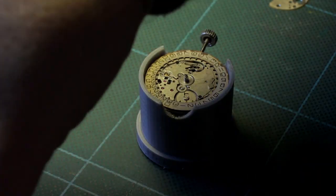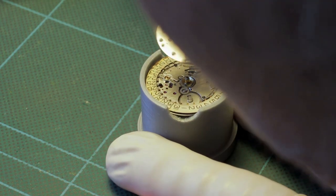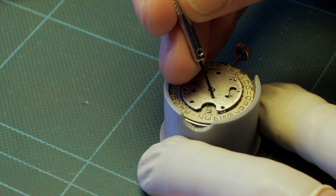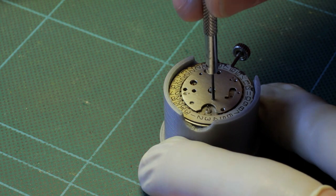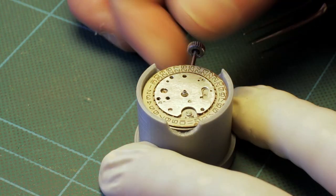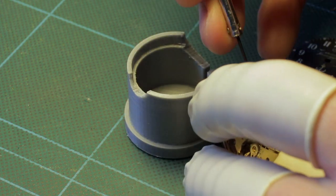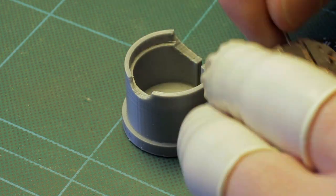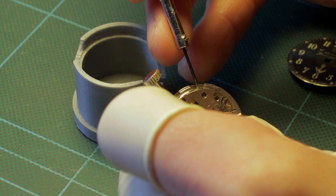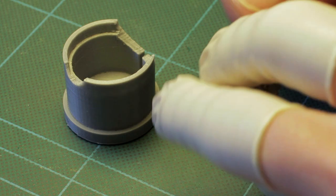It's a good feature because the recess is built into the cover plate, and that large slot that you can see at the bottom allows you to screw down the cover plate, get everything into position, make sure that the jumper is down at the teeth of the wheels, and then slide the shepherd's crook spring into the slot, which then locates after you've got the cover plate in position, which obviously gets rid of the risk of it pinging away while you're trying to position the cover plate. So that's a nice little feature.